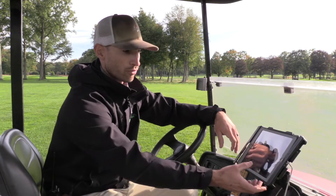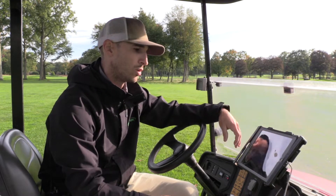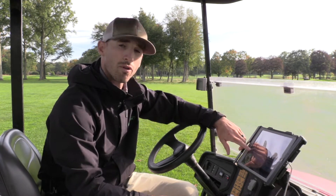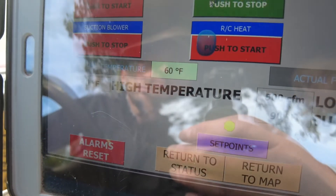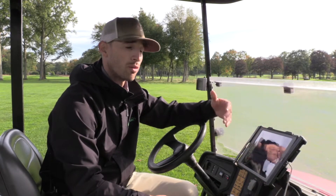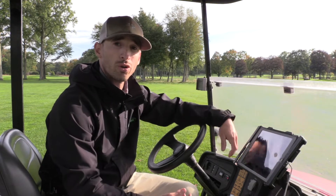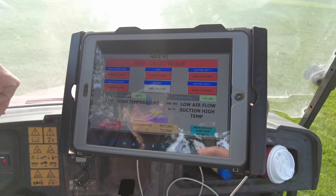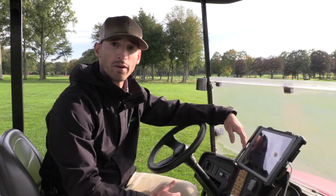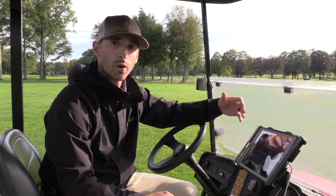We also have a high temperature alarm, a low flow alarm, and a suction high temp alarm. If you're running the unit in cool or just a normal day in suction, the high temp alarm — you can set it; we have ours set at 90 degrees — so if for some reason it hits that temperature, it'll shut the unit off automatically. The low flow alarm would be for if you're running suction. You can set it; we have ours set at 500 cubic feet per minute. That tends to mean there's water in the pipes, it's not sucking enough air — there might be an issue. It'll shut the unit off and send you an alarm saying there's an issue with unit number one, go take a look.